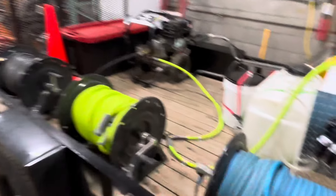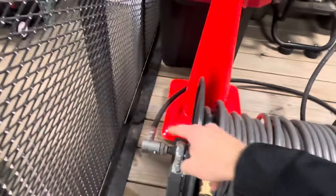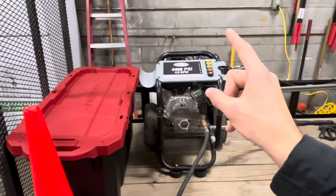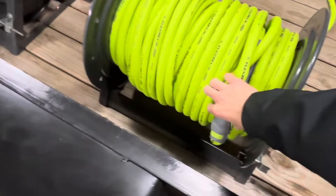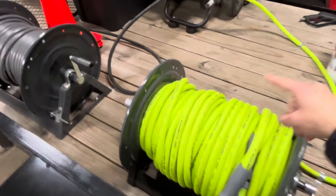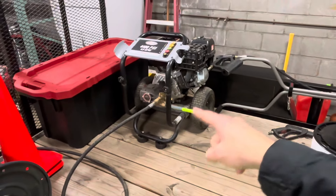Starting out with all of these hose reels — this one is the high pressure. It basically goes through a swivel and a jumper cable that goes all the way to the pressure washer. This is the garden hose, so I'll go ahead and hook this up to the client's house. The water will run through here into this y-adapter and it'll go to the pressure washer if I'm using it at the time.